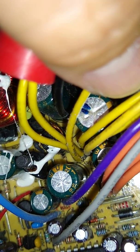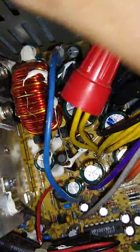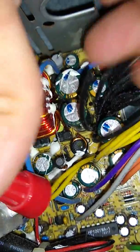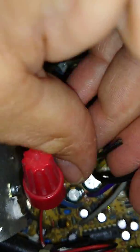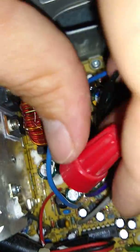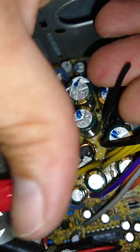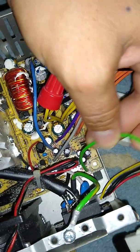You have five-volt, and on the yellow one it should say 12-volt — there it is, 12-volt positive. There's also 12-volt negative and 3.3-volt. Since you need 12 volts, you're gonna grab one of the yellow 12-volt positive wires and two of the black ground wires. You said you needed two 12-volt outputs — one for the pump and the other for whatever the other device was.